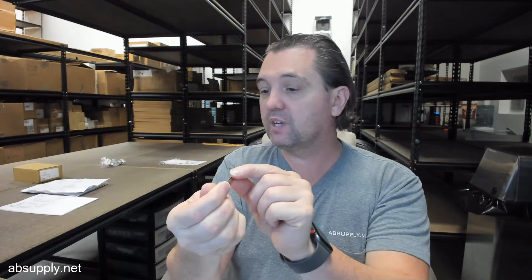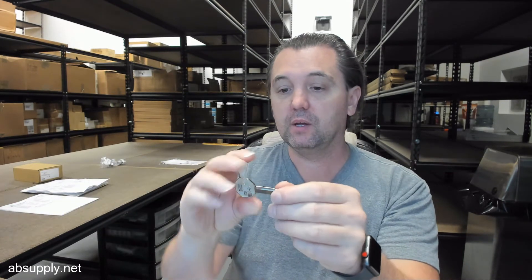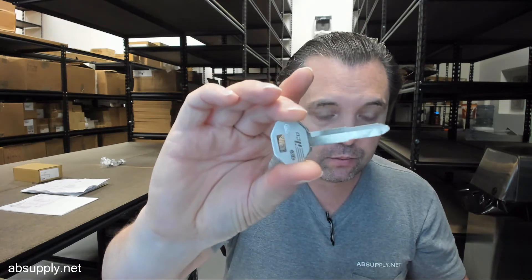It's a cross-section of the key, however, as if you're not looking at the tip of it, but as if you were looking down into the cylinder itself. So if you look at the tip of your key, it will be symmetrically opposite of what the milling profile is that is shown in front of you. So that would be a way to know how that is.